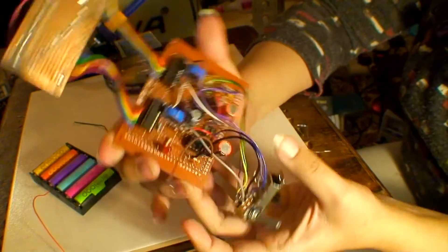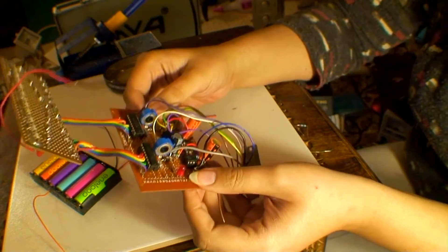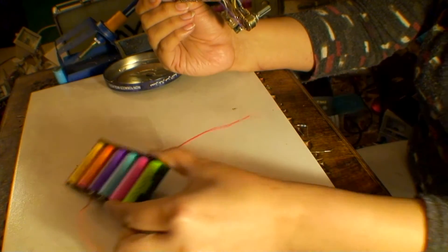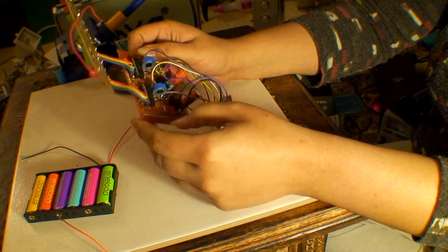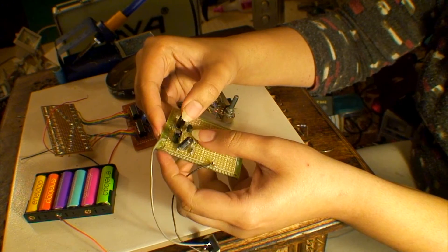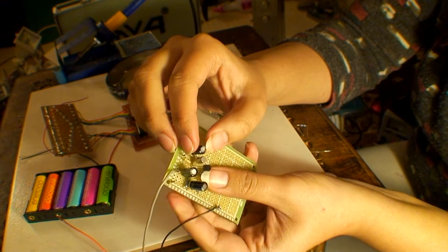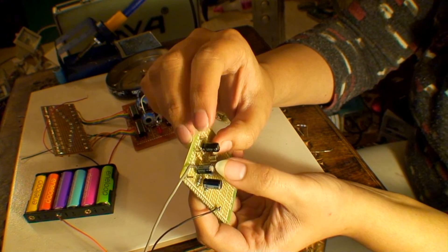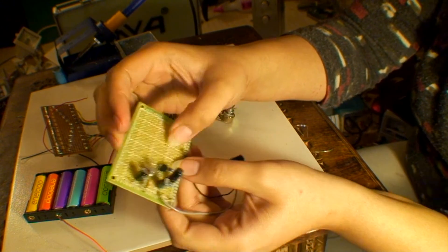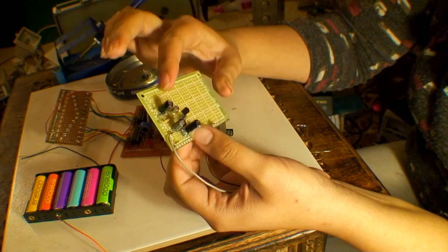Good news — it actually works. I will take more photographs of the circuit and we will go through a test. I'm adding a little something to this because I've noticed it does not use any power whatsoever. I've got 9 volts here and this is going to last me a long time. What I want to do is build a two-stage amplifier along with this — one of them is a Darlington pair transistor amplifier. The audio will go in here first, come out of there, and then go inside here. I think that'll be better because the output of this is designed for headphones.